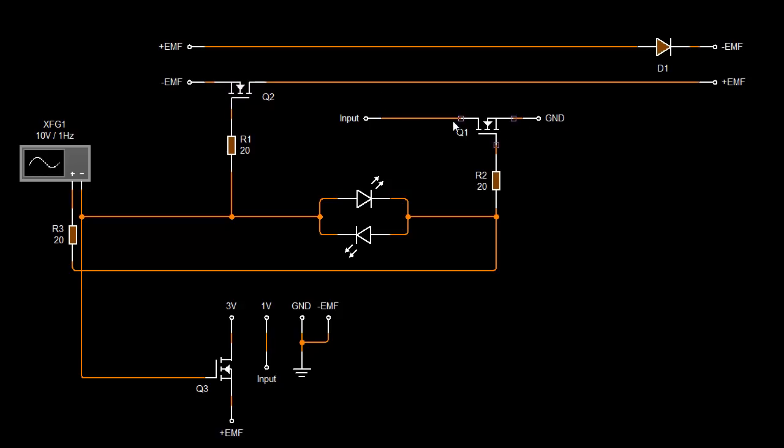This wire is exactly three times longer in this simulation compared to the input coil. The same story again — so this will carry three volts, and this will carry three volts as well. Three volts down here is simulated. This is the electromagnetic induction — Faraday's law of electromagnetic induction. Because the wire length is three times longer, our input is one volt, so the time rate of change — basically a stepping-up transformer induction — will be three volts approximately.